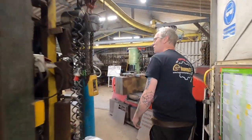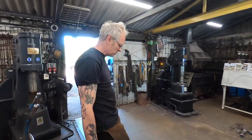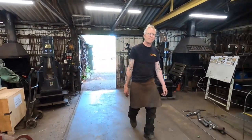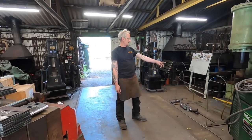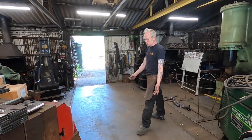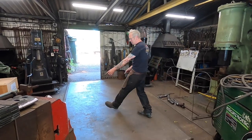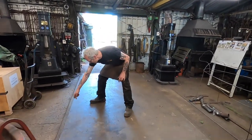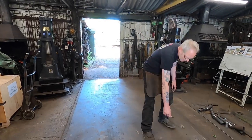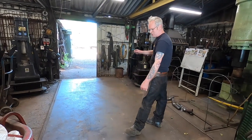This plate of steel cost me about 2,000 pounds — now it's about 1,500 quid — but it's a huge jumbo sheet of steel plate I put on the floor. I have steel plates around the hammers so we can put hot metal down, but I use this for marking out. When we're doing gates and stuff, it's mild steel, 20mm thick. I work a square edge off the edge of the sheet using a builder's square, and then we can tack weld stuff down so when I'm working on it it doesn't distort.